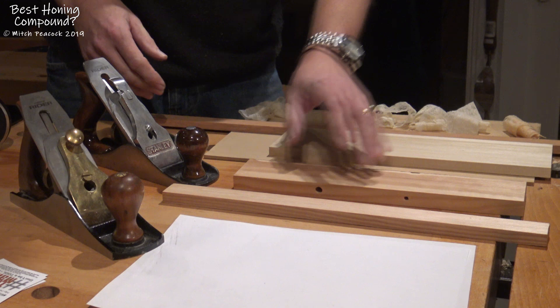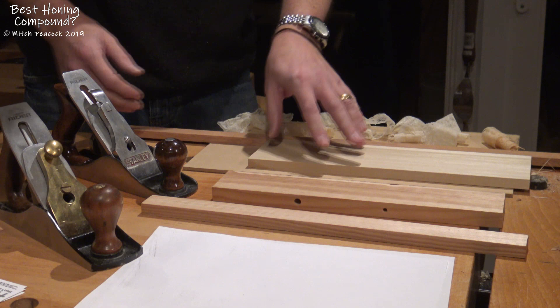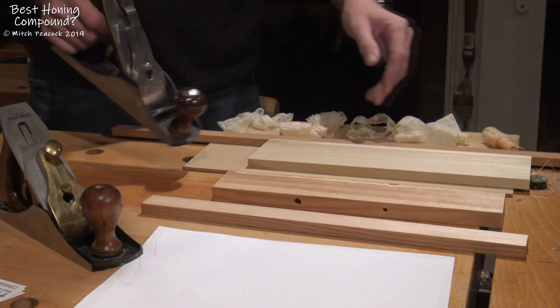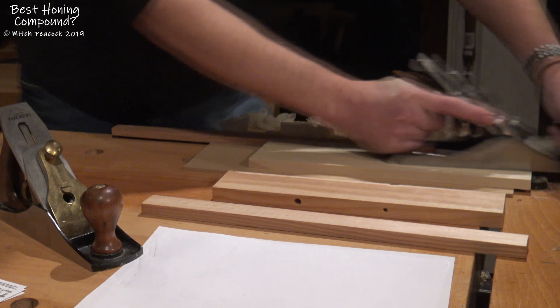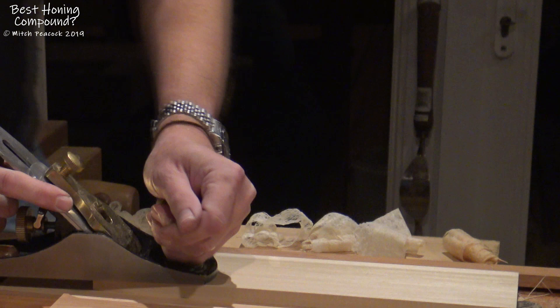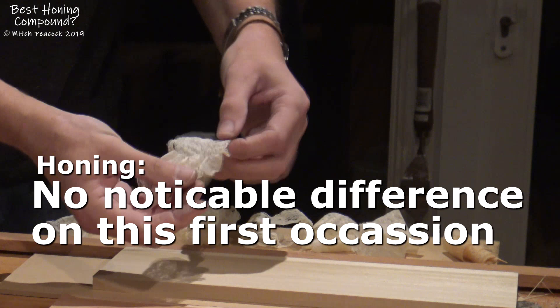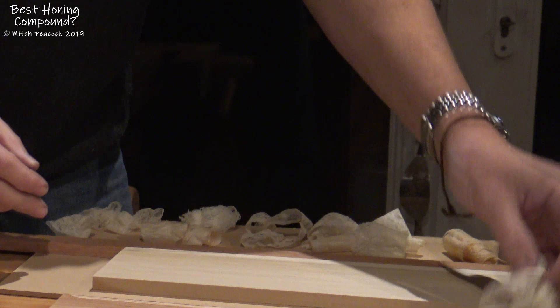The woods I have are some American white wood, some pine and some Douglas fir — they're all slightly open grain, so I'm not going to get completely coherent shavings. And that's exactly what happened when I dialled it down to taking a fine shaving. We get shavings which are complete, but obviously you can see the individual fibres in there. I tried both irons, and to be honest, I couldn't tell the difference in either the shavings, the thickness of the shavings that I could go down to, or in the surface finish left on the wood.